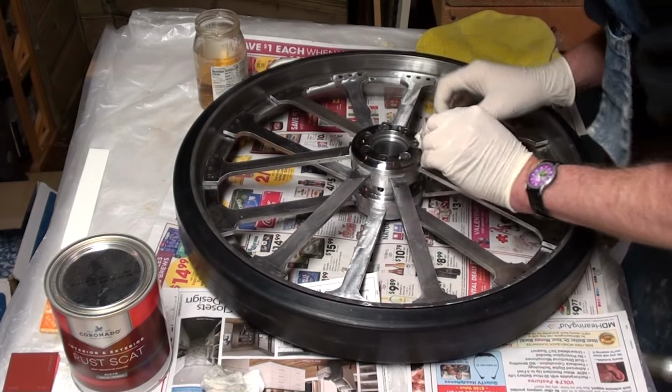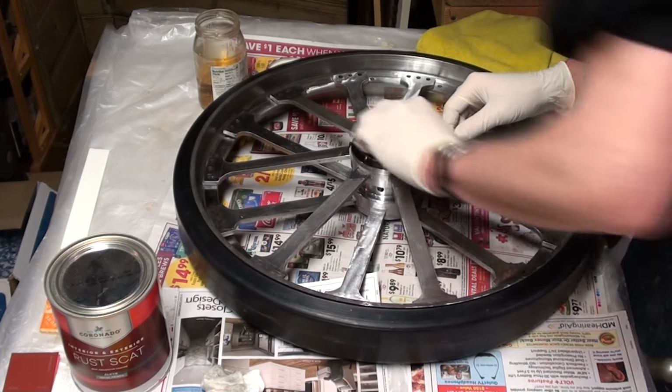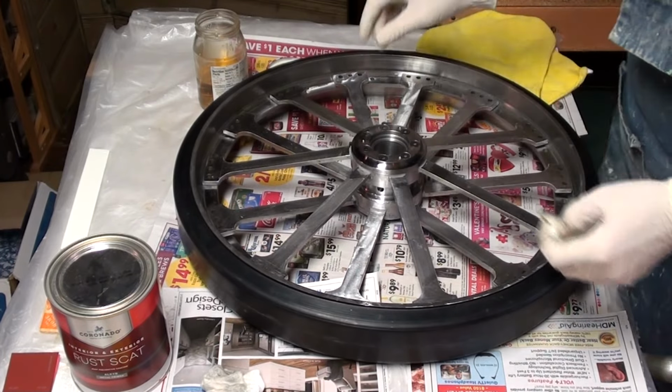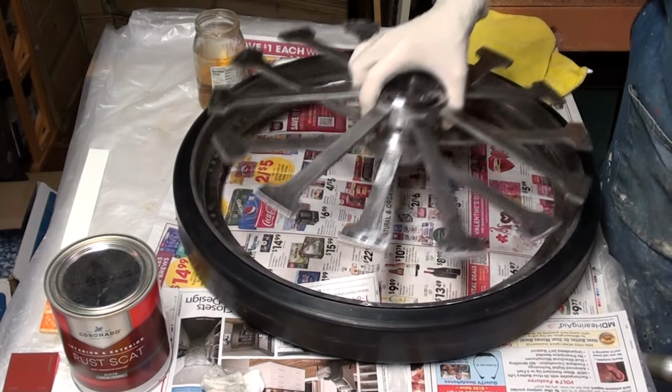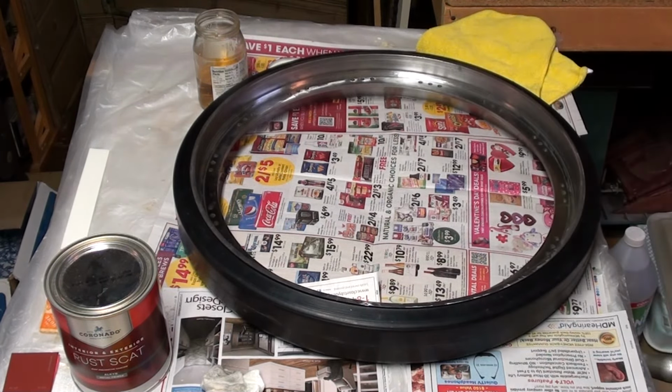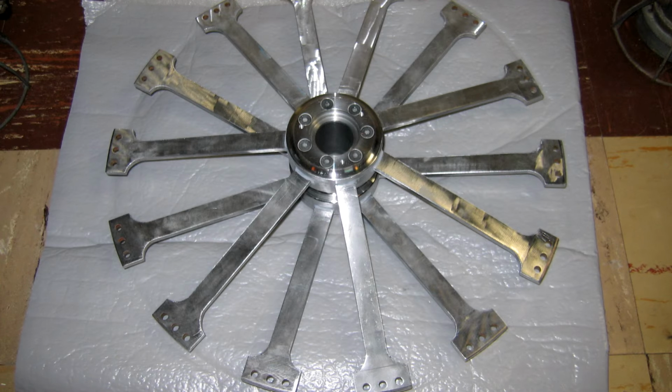We were concerned about leaving bare metal between mating parts and so opted to stray a bit from the instructions. Once the JB weld had cured and all joints cleaned up, we removed all bolts from the spokes at the rim and separated the spoke and hub assembly from the rim. Each was primed separately and painted.